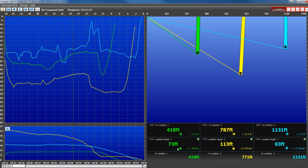For additional information on the system, you can see the depth of each of the lead line sensors. Depth will indicate if the seine is around the fish before you start the purse, and will also help avoid hang-ups on the bottom.